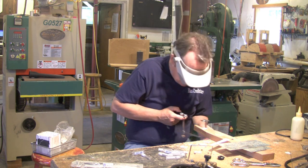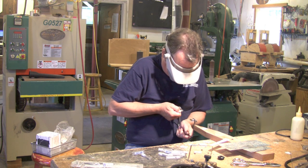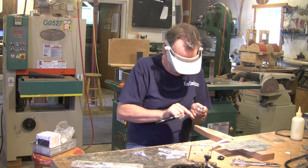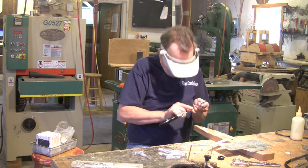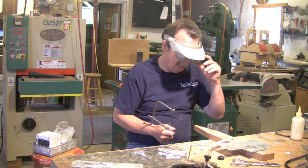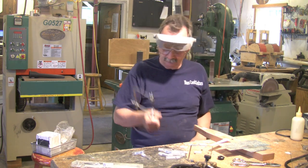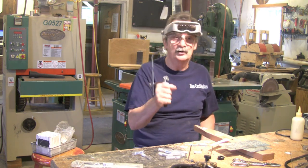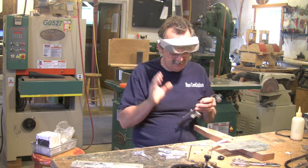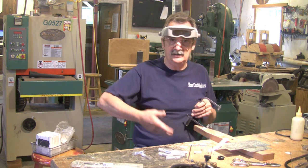When I go to put the blade in I can push against here. It's probably an A flat. So now I have this in here — I'm ready to cut. What you need to be aware of is your body position. Do not hold this like a coping saw — this is just a light touch, just light. I do not hold this very hard. If you hold it hard, your hands are going to clamp up. Keep your shoulders relaxed. I love to put some slow blues on when I'm cutting pearl — it puts me in a good mood, it's a nice rhythm.